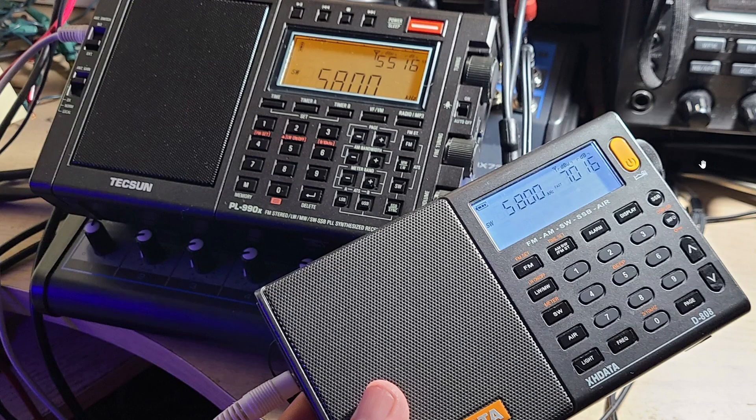Overloading generally occurs from stations very close in frequency to where you're tuned. If I'm on 5800, I might get overload from 5935, but not from a strong station on 11800 — that's too far away. It typically happens within the same meter band or just a couple hundred kilohertz apart. For example, you might hear something on 5900 and get overload from something on 6100. I'll intentionally demonstrate overload in an upcoming video.